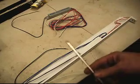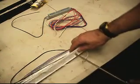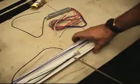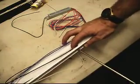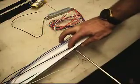I got a number 2 Phillips. I need to back these screws out here. There is a nut on the other side. Usually most of these ballasts don't have a lot of tension on that nut, so you can put just your finger pressure on it and extract it.